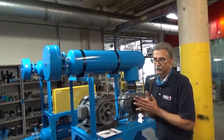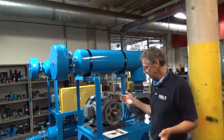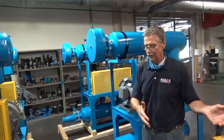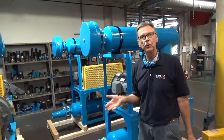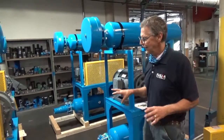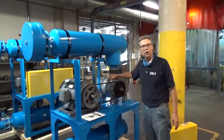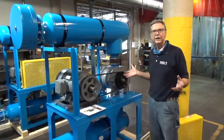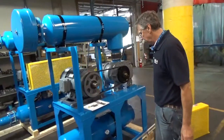What we like to do on startup is start the blower under no load. If there's a way to take your air to atmosphere or to a tank with no water in it, run it under no load or at least a slight load for five or ten minutes. While it's running, listen and look for hot spots, check for excessive vibration, and listen for any kind of funny noises — metal to metal, hammering — anything that shows there's a problem with the blower.